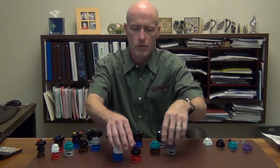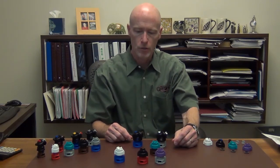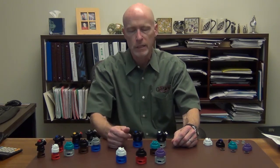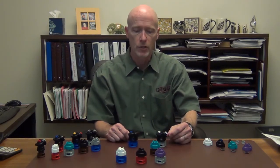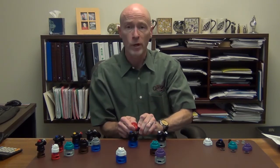In addition to the 6 nozzles that we have approved for Monsanto's XtendiMax herbicide, we also have 7 nozzles approved for Dow's Enlist Duo herbicide. And there's some overlap between the 2 application recommendations. So we have these 3 nozzles, which are part of the XtendiMax approvals, that are also approved for Dow's Enlist Duo. So the 03 TDXL-D, the 04, and the 06, all in the TDXL-D version, are approved for Enlist Duo. Unfortunately, no dual fans are approved yet for Enlist Duo, but again, you can switch back and forth and use a dual fan version for one application and go back to the single fan D version for other applications.